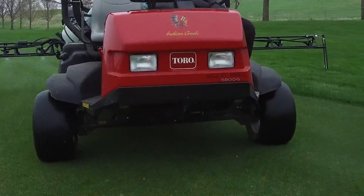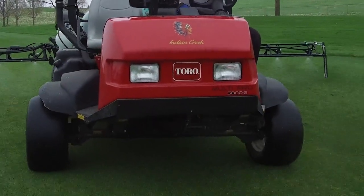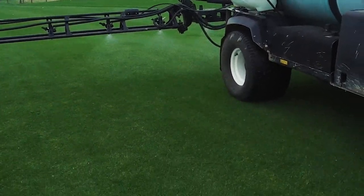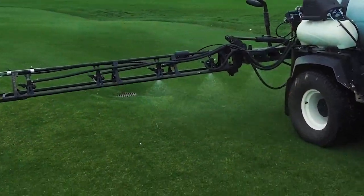The other really unique part is individual nozzle control. On the older sprayers, the boom is on or the boom is off. Now it's the nozzle's on or the nozzle's off. So as you're spraying an area and your booms are hanging over your boundary area, in the past if three nozzles were hanging off your boundary area and one wasn't, the whole boom is on — so you're spraying six feet or three to four feet beyond your boundary. Now it's individual nozzle, so you're not wasting product, you're not over-applying product, you're not overlapping.